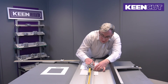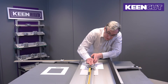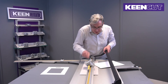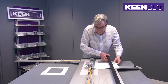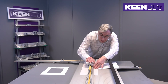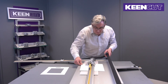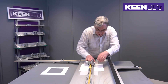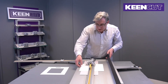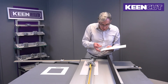Just checking the blade's on the line, starting just past the mark, and just coming past with the finger gauge. Always making sure the bit that's going to fall out is under the cutting arm. Again just past the line on start and finish. And the last cut — there we go. Now it's nearly there; it's slightly under cutting. It's always better to slightly under cut than over cut.